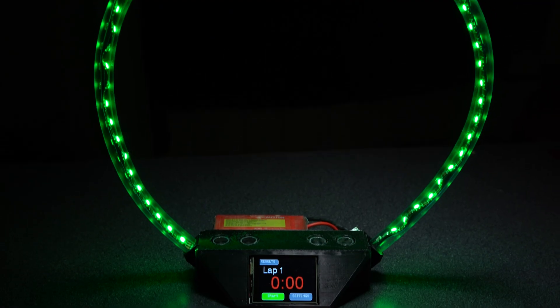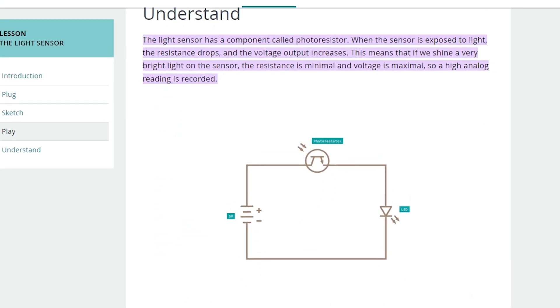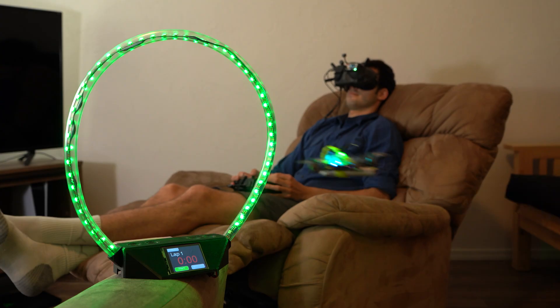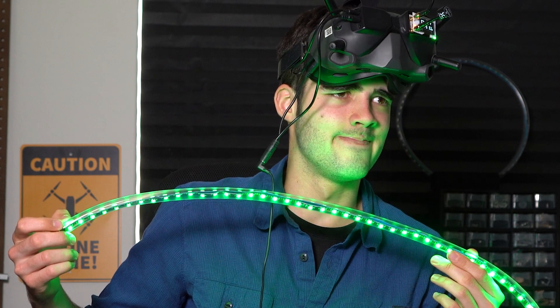The new design has the same bones: ultrasonic sensors for detecting distance, which works by emitting high frequencies and measuring how long it takes to return. I'm also experimenting with light sensors, which could prove to be more reliable as they're able to emit more pings per second than an ultrasonic sensor — but that's to be continued. When a drone passes through the gate, the sound from the ultrasonic bounces off the drone and back to the sensor, which is how I detect if something has passed through.